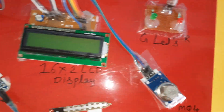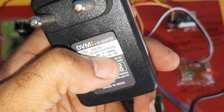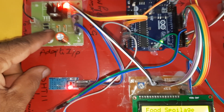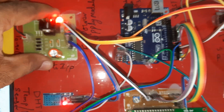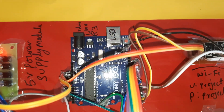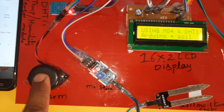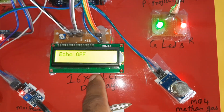Here in the hardware, we are using a 0–9 volt, 1-ampere adapter as the power source. It feeds into a bridge rectifier, filter capacitor, and 7805 voltage regulator to produce a clean 5-volt power supply module. This powers the Arduino Uno R3 board along with the DHT11 temperature and humidity sensor, alarm, and moisture sensor connected to pin A2.